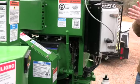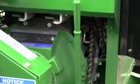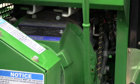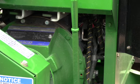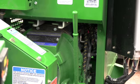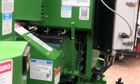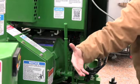Well, the clutch is disengaged, so your clutch pack is sitting right about here compared to that flywheel spinning at your RPM. When you're engaging that system, when you're pushing this handle down, it's pressing these plates together, and now your clutch is picking up to that RPM of the engine. So as those plates start to bump together, now you're bumping it off, as they slowly bump together, get some speed behind them, when you let that handle go, they're running together, that disc, this belt, everything is running in motion.